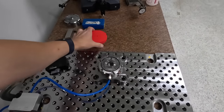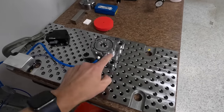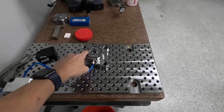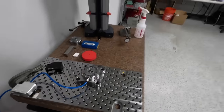The task at hand for the surface grinder was we want these puck chucks to be flat, accurate, and consistent as between the bottom datum — resting on the surface plate — and this ring right here. There's a dual contact with a minor amount of flexure, with a tapered ring pulling down against the outside Z datum. So this is what sets your Z height. We want them all matched when you buy four at once, and if you buy a fifth one later, it needs to match that same height.